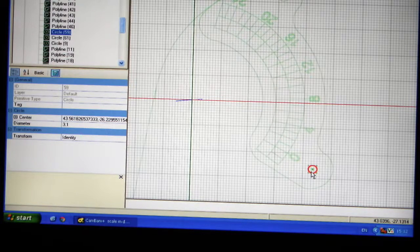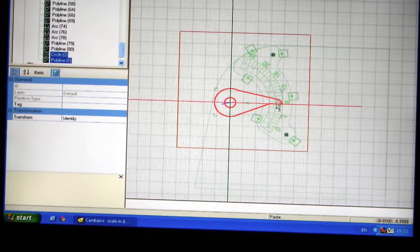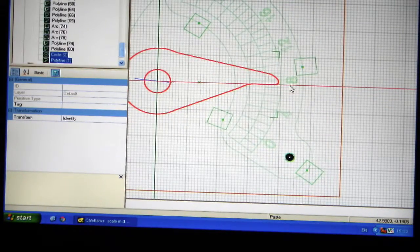I can control exactly where that hole will be. Same on this side - another hole. Once you've got the CNC program to cut the finger, you can overlay the finger on the part, get the positioning right and the radii of the lines correct. Then all you need to do is mark the angles out. I put some paper on the side panel, put the finger at zero position, then tilting the table two degrees at a time and marking out the angles. Once I know the distance between each two degree angle I can step it round, put the lines in and mark it out.